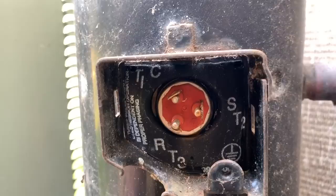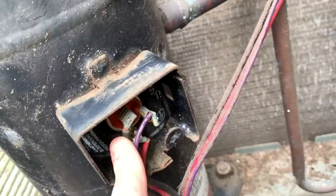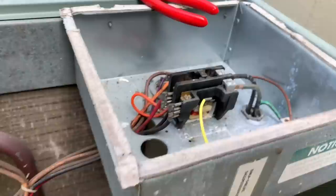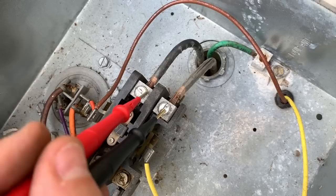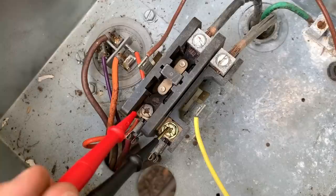A common mistake is doing your testing at the contactor rather than at the compressor itself. Become a master of the obvious. Look at your leads — make sure you don't have any rub-outs. Make sure you don't have excessive corrosion on your terminals. Make sure everything is well connected. These are things expert technicians do that lead to quick repairs where a junior technician might end up condemning the entire compressor. Always put the covers back on to prevent rainwater or moisture from corroding the terminals.